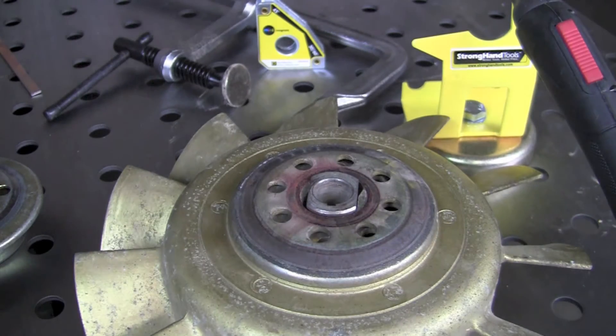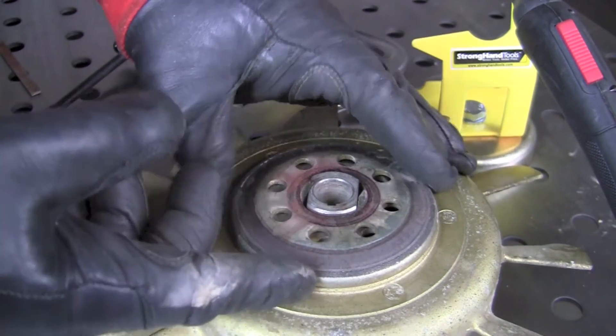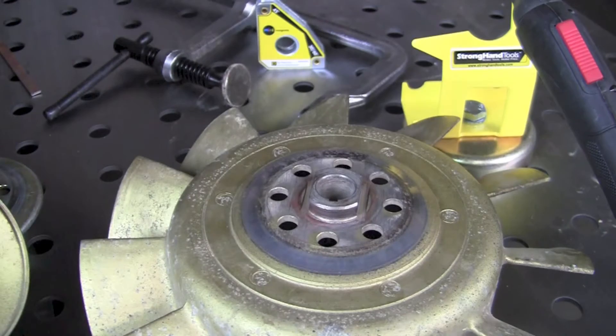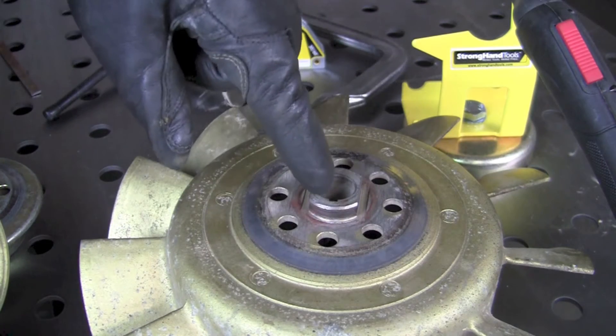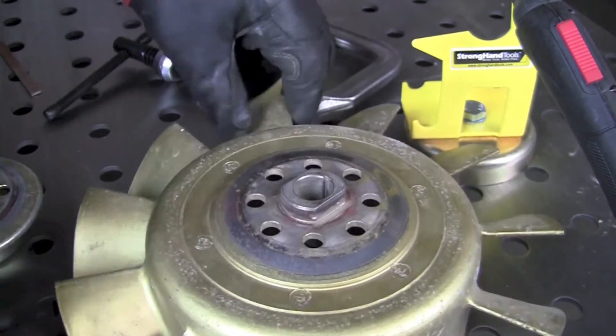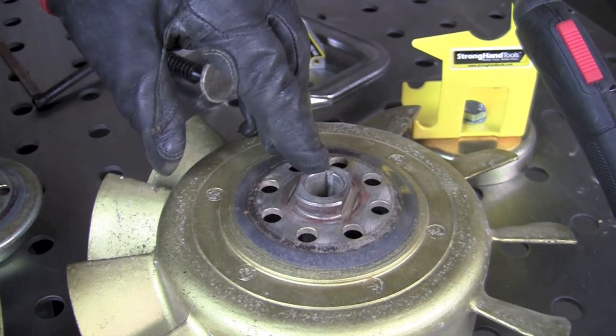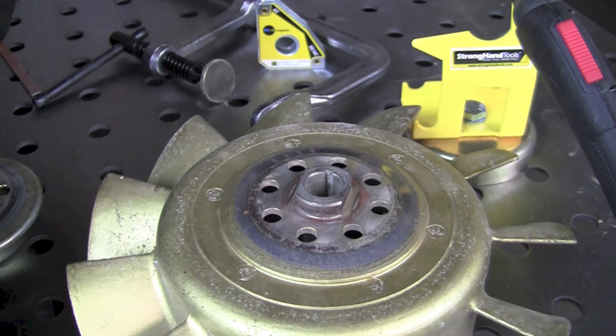Let's take a look at what's actually wrong with the part here. The part has a mating component that fits right on top, and this goes over a shaft. You can see there's a small keyway right there inside the inner shaft where it slips over the keyway on the main shaft in the motor.